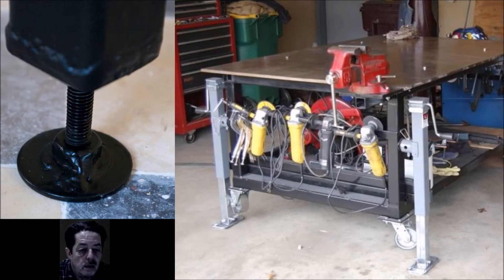Let's take a look at the picture straight up above me. On the bottom legs of the welding table, you can see where he welded a flat piece of steel with a hole in it, and the underneath side has a bolt. Then he used a little pad, welded a nut to it, and screws it up into the bottom. With a wrench, you can adjust your table to where it's perfectly level. It's a simple way to do it — just drill a hole, weld a bolt, put the nut on the pad, and screw it in.